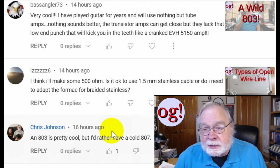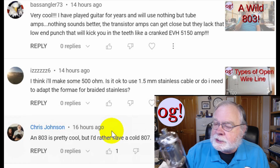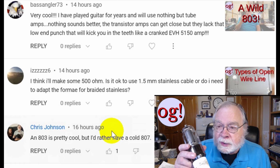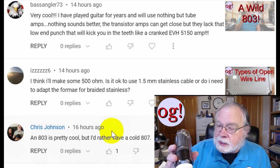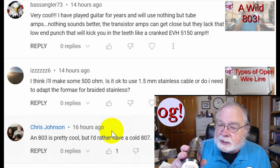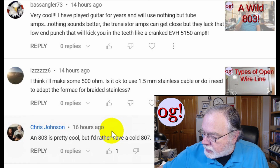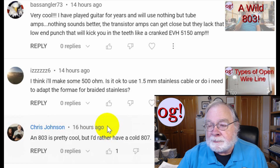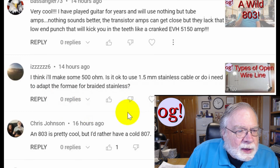On FM, you can go considerably higher. Now, some people have pointed out on this tube, it will do Class C for telephony. Telephony means voice. Class C means it's only giving a little kick every so often to the tank circuit. If you use high-level modulation, I'm told that's okay. And that puts a lot less strain on the tube.